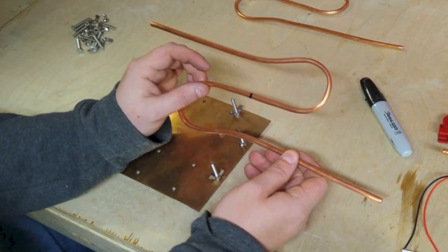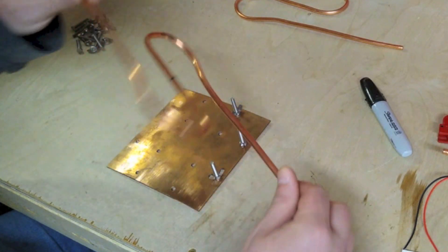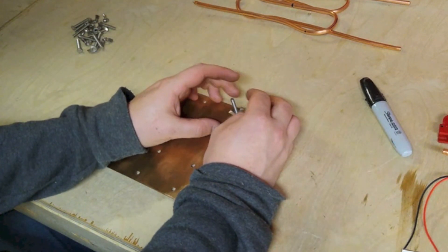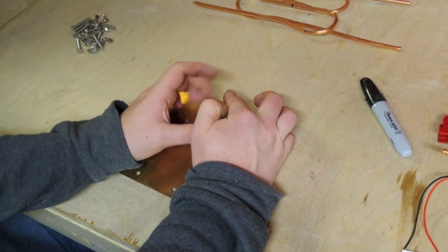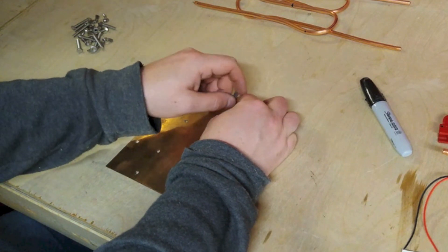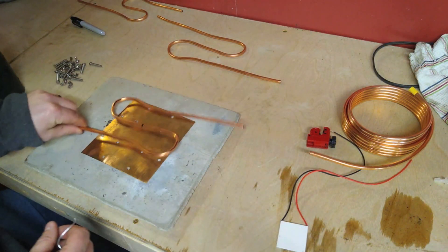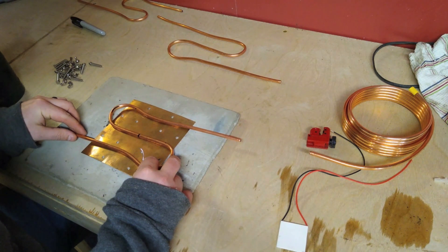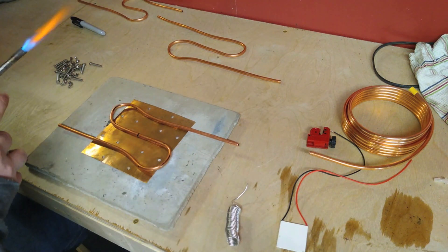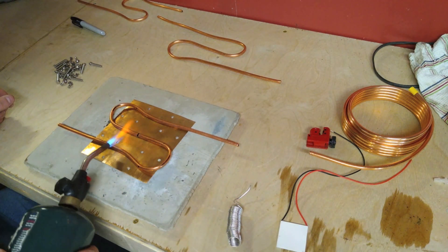I went ahead and made a couple of these off camera, because I've gotten this wrong quite a few times before getting it right. Copper pipe is really hard to bend. What I need is two copper sheets to attach these modules to — one side to heat and the other to cool. I want copper both because it's thermally conductive and because I can solder it easily. I need to add copper pipes to transfer steam and cold water to the area just on the other side of the plates from the modules.